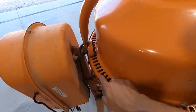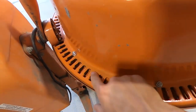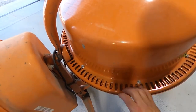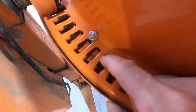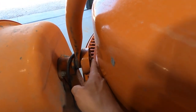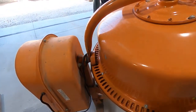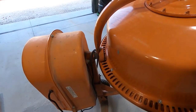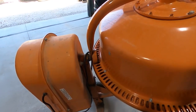See this little gear cog right here that spins? Before I use this mixer, I always spray some kind of dry lubricant on it. You want to use dry lubricant — not wet — so concrete dust or mortar doesn't get stuck in there and make a mess. There's not too much wear yet, but I've run a lot through it. Also, this gear cog screw was coming loose for a lot of people I talked to — they'd lose the washers and lock washers. I saw that as a problem early on, so I put blue Loctite on that screw. I've not had it come out at all. Don't use red Loctite — that locks it in permanently. Blue Loctite is what you want.